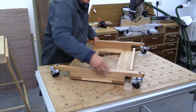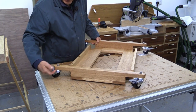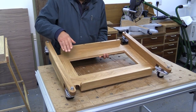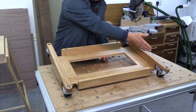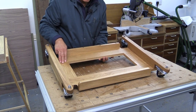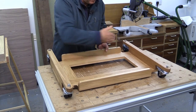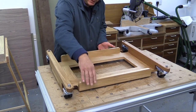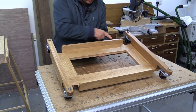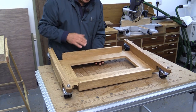The design is very simple. The principal parts are these two end frames — one here and one there — and this is a solid piece of oak which has been cut out. The casters are mounted through the ends here and here, and this is mounted onto a base plate. The base plate is made up of four pieces of wood: two long pieces that go all the way through from end to end, and two cross pieces. These are jointed with three domino tenons at each joint, and of course glued. For stiffening, there's a piece at the front which is glued and screwed onto the frame, and a piece at the back which is screwed using inset screws that can be removed, so when putting the machine in situ, this is removed to make it easier to get the machine onto the carriage.